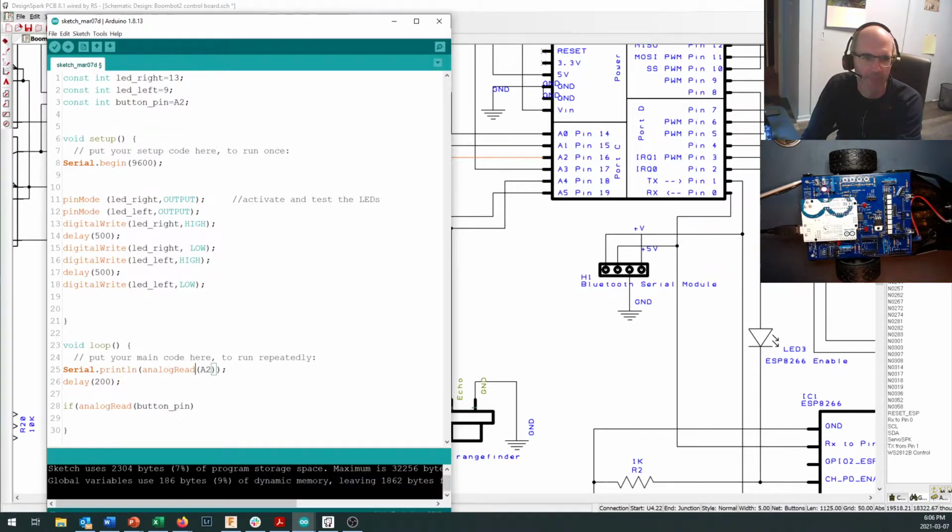There we go. I was getting lazy in here on A2. So if analog read button pin, let's say, is greater than our second value, 750. Let's say if it's greater than 900. Okay, so that means that one of our buttons is pressed, because it's at zero when no buttons are being pressed. Then what we'll say is